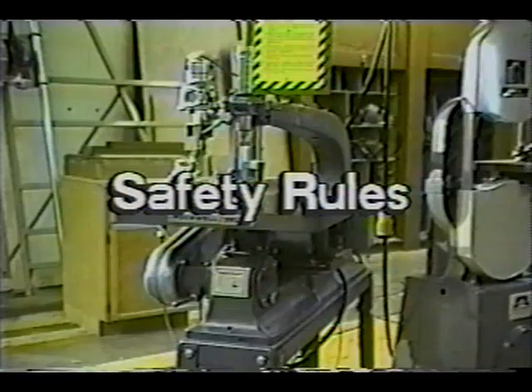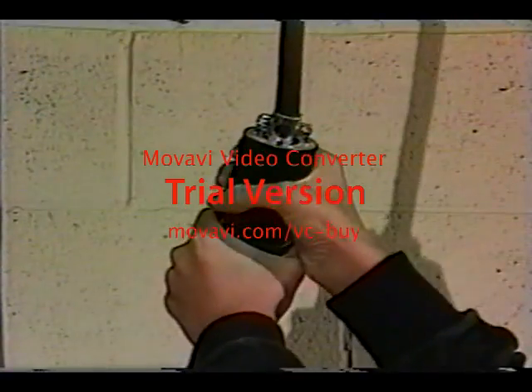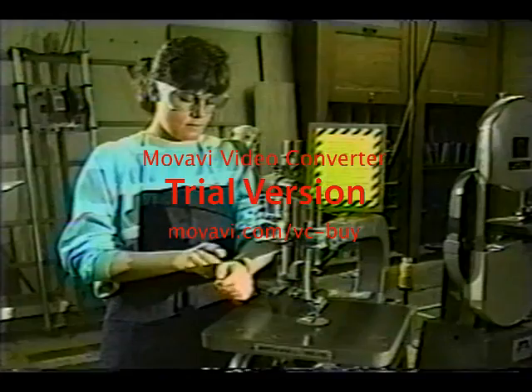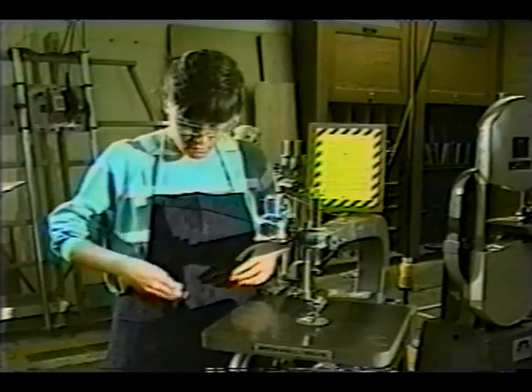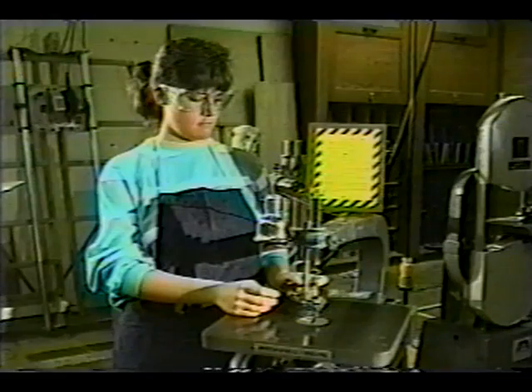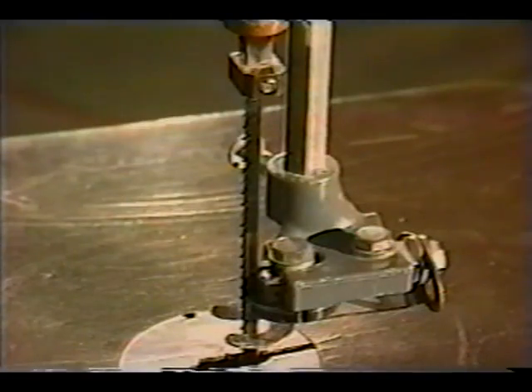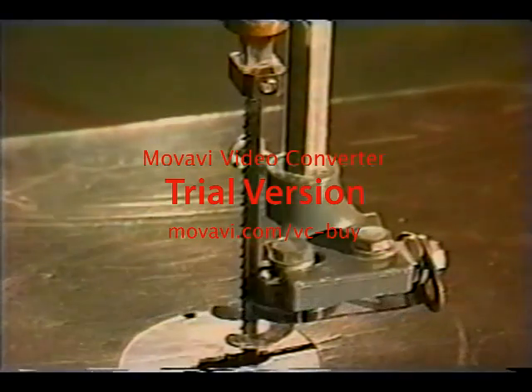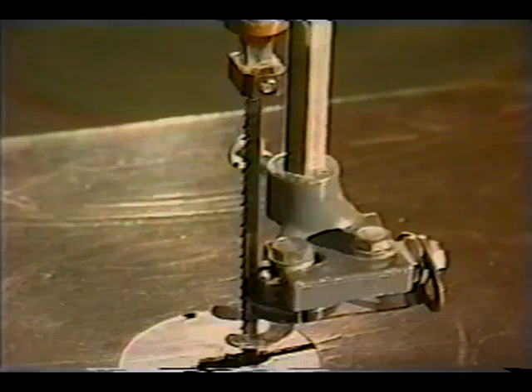The scroll saw is a fairly safe power tool when used properly. Like any power tool, you should make sure the power is disconnected before setting up the saw or changing blades. Avoid loose clothing that might get caught and keep the table free of scraps or loose tools. Wear the proper safety gear. Use the proper blade — be sure to select the proper blade for each specific operation. The blade should be sharp and straight. Be sure the blade is securely mounted with the teeth pointed down. Don't try to make a blade do a job for which it's not expressly designed.